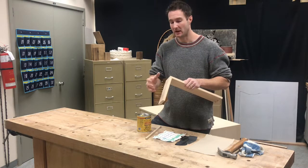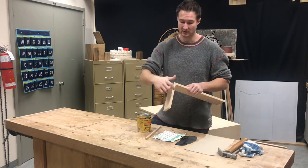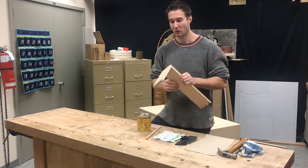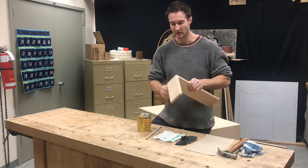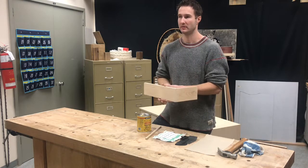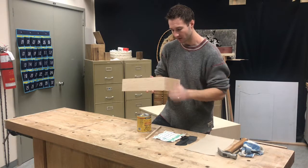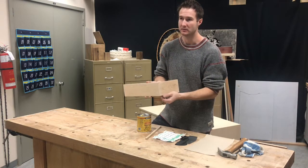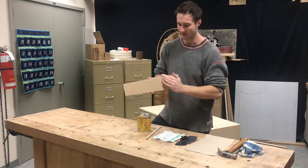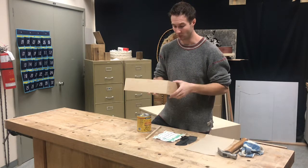You're not doing this with a power sander. Power sanders, especially on your relatively narrow stool leg, it's going to end up really soft and mushy-looking. The whole purpose of easing the corner is for it to look crisp but not feel sharp. When we look at this it still looks square and crisp, but when we rub our hands on it, it doesn't feel sharp. I've just taken some 220 grit paper and worked over these corners to make them feel nice and smooth.